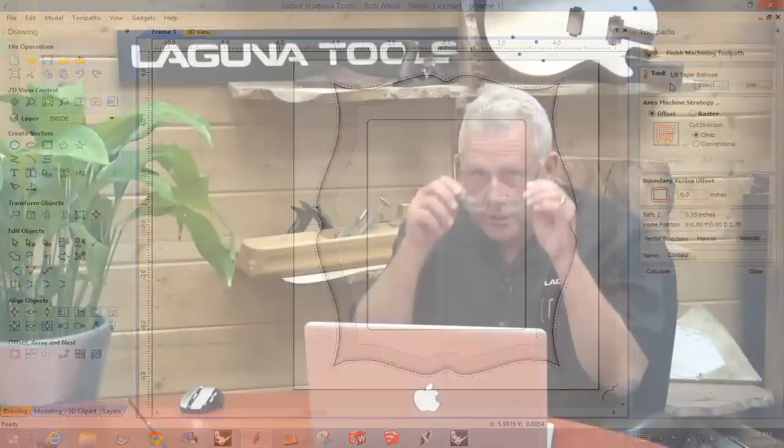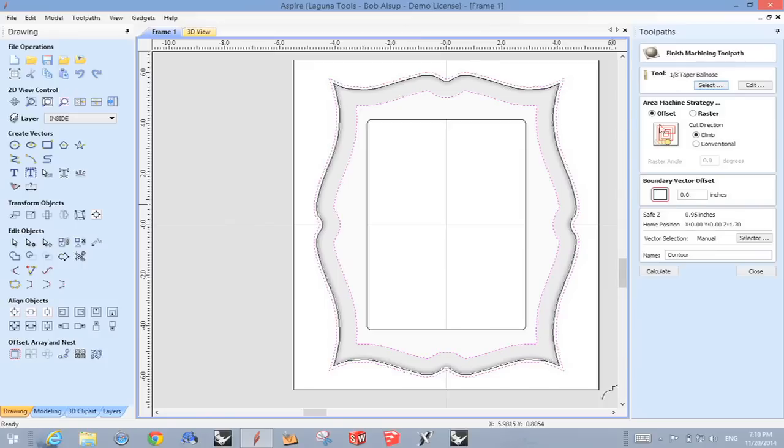Okay, I used an 1/8-inch tapered bit, the tapered ball nose. This one is a Vortex 2215, I believe. So it's a round ball on the end. It's 1/8 of an inch. It tapers up to 1/4 inch with a cutting edge of about 1.5 inches. So the angle's about 3 degrees. And it does really, really well cutting this 3D stuff. All right, now, so that was the first thing I did.